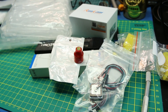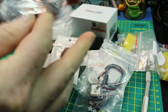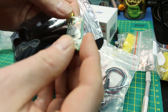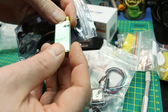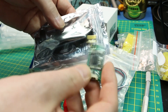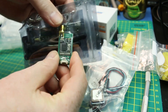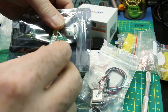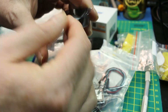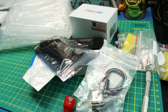And 3DR radios. I don't know how well this is going to work because these are not the 3DR branded radios. These are 433 megahertz, not the 900s, so these are just a serial receiver and transmitter. I did a video just recently on iNav getting these working and I was so happy that I can program my iNav from my laptop over the air now and get telemetry home. But I don't know how well this is going to work — I did have trouble with the no-namers. The 3DR radios worked flawlessly though. We'll give it a go — I think I can make it work. We can make anything work here on the channel.